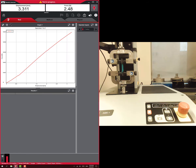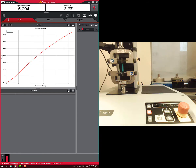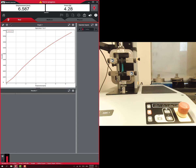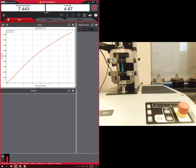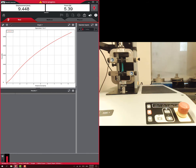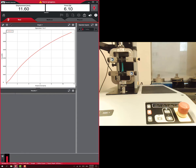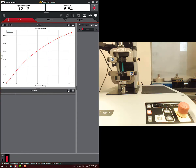So if you remember what's going to happen — it's going to pull to 12.5 millimeters and then go back to zero, one cycle. And pretty cool — you can see there is a lot of hysteresis in this rubber glove. There's a lot of area between those two curves.